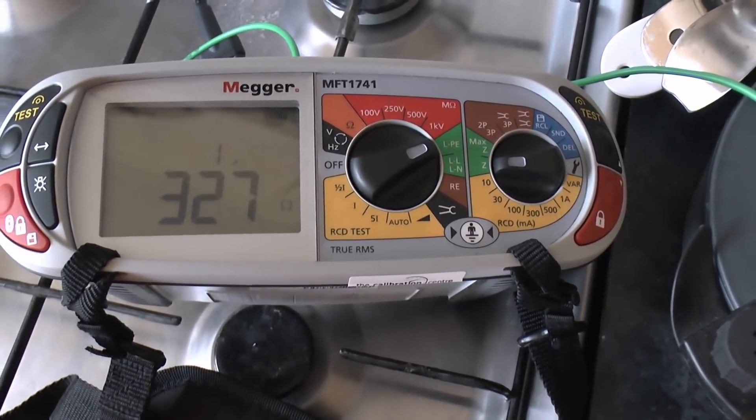So fairly consistent with what we had outside — about 300 ohms. The Condi Disc is getting a reasonable reading there. It's about 300 ohms, which is higher than the rod, but bearing in mind it's only about 12 inches below the ground and wasn't put in as a permanent installation, 300 ohms is still perfectly adequate. We will be seeing this again because it's going to be installed in an actual installation, buried somewhat deeper, and we're also going to use some conductive concrete with it. But that's pretty much it for this video — until next time, thanks for watching.